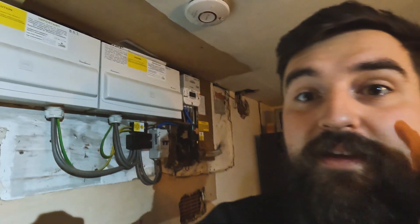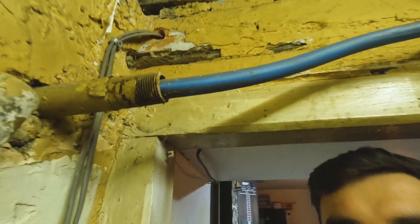What we'll do is get these imported into the testing software. So we're just doing a few checks - you do a visual check around the property. You're checking for cracked sockets. When we whip the fuse board off, we'll be checking the cable size to the breaker size to make sure the breaker's going to trip before the cables set on fire. Also bonding - it's a plastic pipe coming in through water so it's got some electrical separation, so you don't need bonding to it.